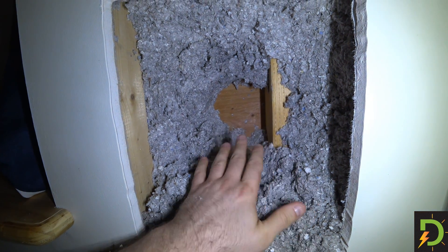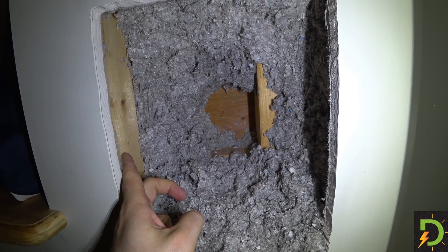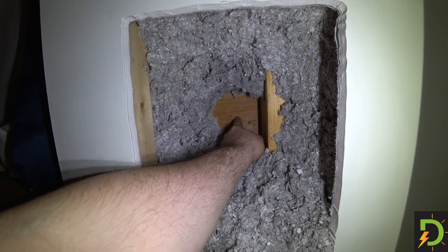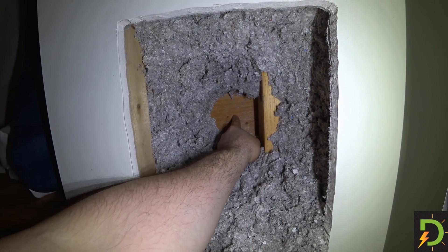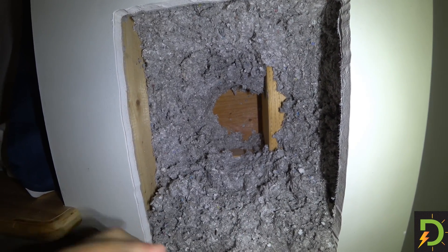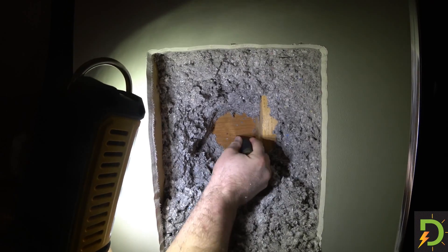Here's the cavity — it's all filled with cellulose. This is the exterior 2x6 load-bearing stud wall, and here's the interior 2x4. This is half-inch CDX plywood and I actually have Grace brand ice and water shield on the outside of this. So this plane is my air barrier, and that Grace ice and water is actually a vapor barrier on the outside of my stud wall. So this is the condensing surface.